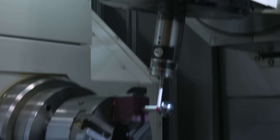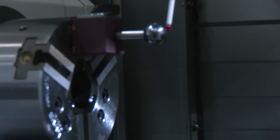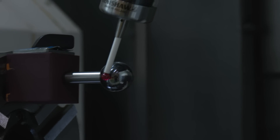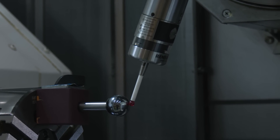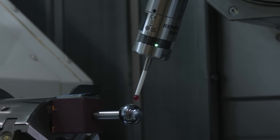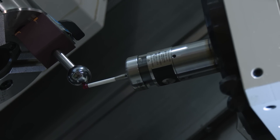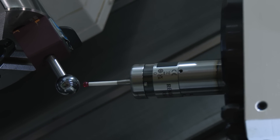What we have here is a Renishaw probe mounted to the spindle, and we're checking a gauge ball to find the exact location of that B-axis center of rotation. Any time you move the machine — or in some cases if you bump the B-axis — you need to find that center rotation again. If it's off by even two, three, or four microns, that can make a difference in your surface finish, your corners, your fillets. Having this software makes it easy for the operator to find that center rotation basically automatically.